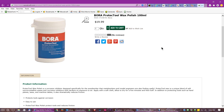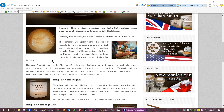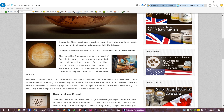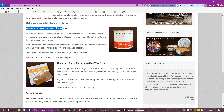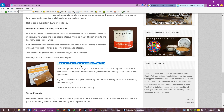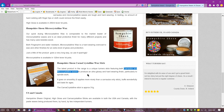I'm probably going to be using microcrystalline wax to wax the bedways of my lathe as well. All right, let's switch back to the workshop now. Late breaking news — this is a product I had missed when preparing the video: Hampshire Sheen. Hampshire Sheen has a number of different waxes, and apparently all or at least a few of them contain microcrystalline wax — a blend of food-safe drying oil, carnauba wax, and microcrystalline wax. One of their products is apparently fingerprint and water resistant, and probably all microcrystalline wax. Hampshire Sheen also has their Carnacrystalline Wax Stick, which features both carnauba wax and microcrystalline wax.